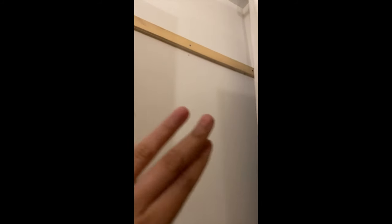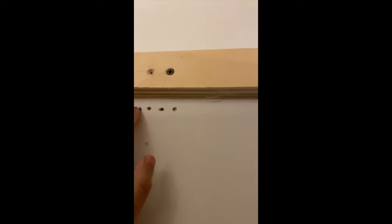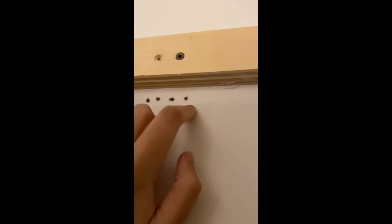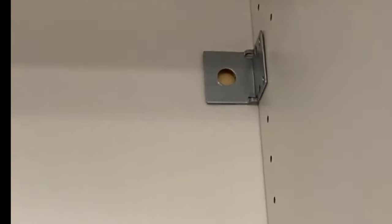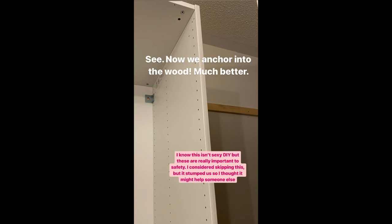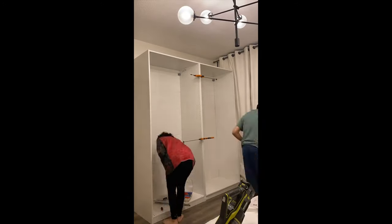Because of that failed hole, we created what's basically an external stud — a piece of wood mounted flat on the drywall, with all its own screws going into actual studs. This is a great alternative if this happens to you or you need a really secure anchor point. I tested by screwing pilot holes to find the stud locations — some went right through into drywall, but one hit a stud, so I positioned the wood there. The brackets go through the wood, making it super secure — way better than anchors. We have three small kids and always go above and beyond when anchoring things.